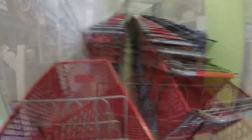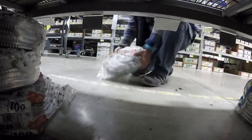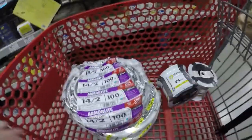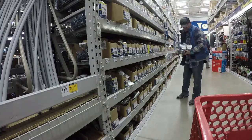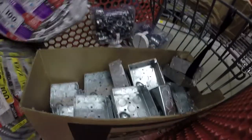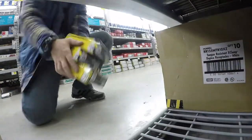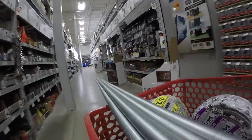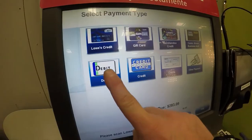I hit up my big box store and started grabbing everything I thought I would need — turned out to be one of many trips. I got 100 feet of 12-2 armored solid metal clad wire for the outlets that are hard to reach with conduit, and 14-2 for the can lights. I also grabbed 12-gauge wire connectors, half-inch conduit connectors, 3/8 clamp connectors for the armored cable, lots of electrical boxes, 30 outlets in contractor packs — that wasn't even enough — and 100 feet of half-inch conduit.